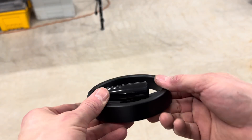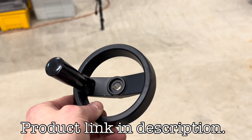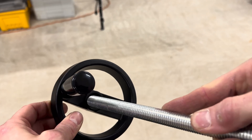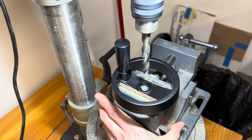The hand wheels are the only parts that weren't left over from scrounge or extra stock that I had from other projects. The wheels themselves are aluminum and they had a one centimeter bore, but the rod that I had on hand was 5/8 inch, so I had to do a little bit of modification to both to make this work.